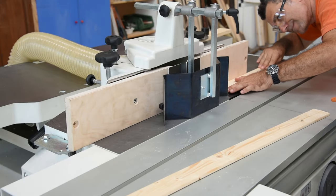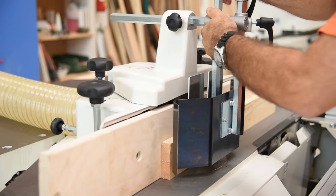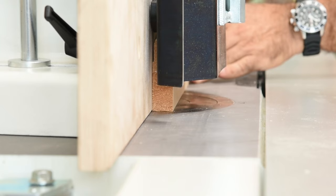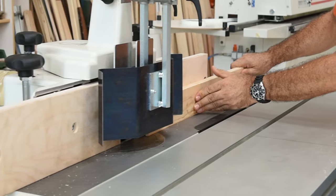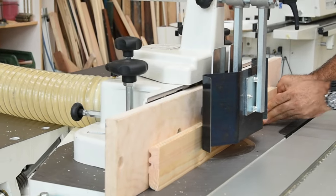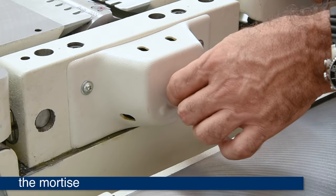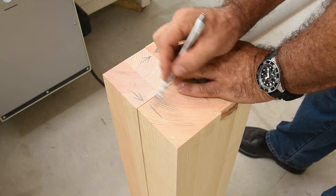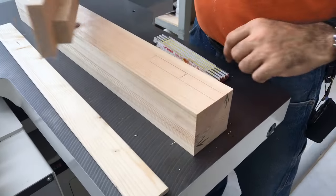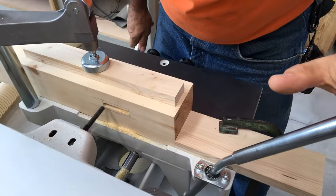Then while we have the shaper stuff installed, we will change the profile and cut our moldings. This molding will be a two-stage molding, which means we will use two different setups to achieve the shape we want. A multi-profile insert set like we are using here is a great way to get into shaper tooling for those new to a shaper. Here you can see one of the biggest advantages to using a shaper instead of a router table — we only need one pass rather than having to do multiple passes to get to our desired depth of cut. Time to install the mortise bit and set up to cut the mortises. We only need to mark one leg for the corners and one of everything else, then we set the stops and height and do a run at each setting. This is a very efficient and easy way to cut multiple mortises that are extremely accurate and repeatable, all while maintaining a nice ergonomic body position. Plus you get a larger range in depth than you can achieve with handheld systems.